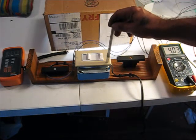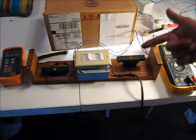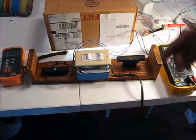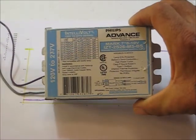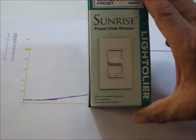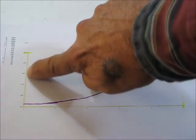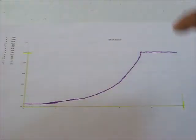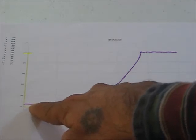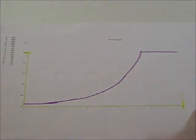That's why it's important to have something you can use to see what the response of the luminaires is, because you're probably going to be putting in programming that specifies a certain 0 to 10 volt output. That's why we have a little test set for it. Let's take a look at what we got from this IZT-type ballast controlled with this preset slide dimmer. We've got an exponential curve. We're not a scientific laboratory, and neither are you on the job site.